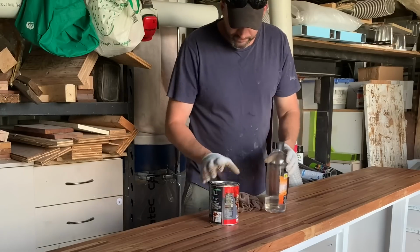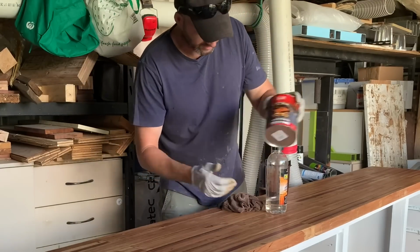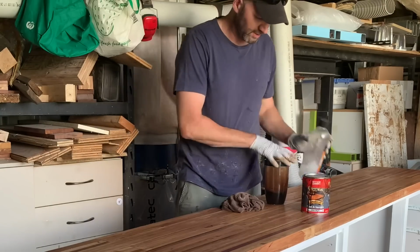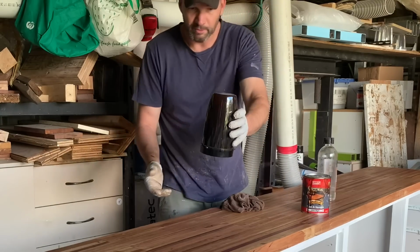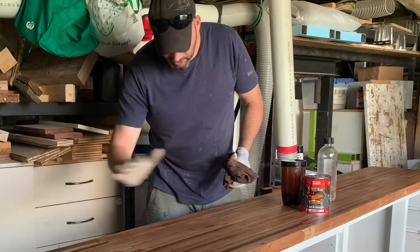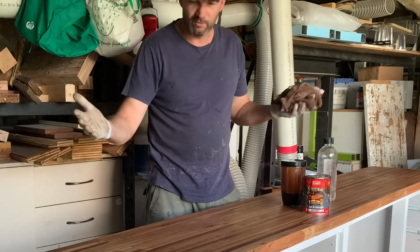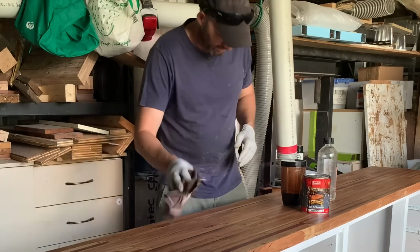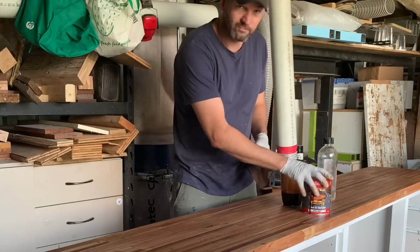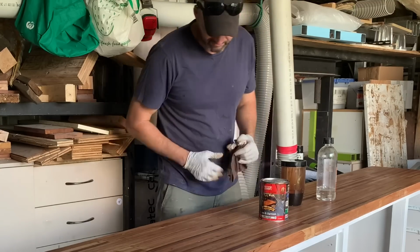Alrighty, so I've just applied an oil-based stain and varnish. It's a walnut, just to darken up this slab top. I've thinned it out with terps, mixed it up in my NutriBullet, and just applied it with a rag. It is just enough to darken it, but keep all that nice slab work, which is the whole point of doing these, in my opinion. Anyway, hopefully the wife likes it. She chose the stain, so it's on her. Done.